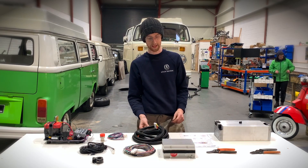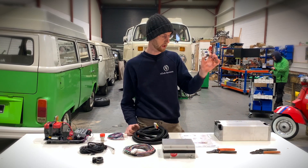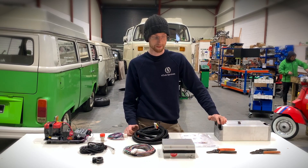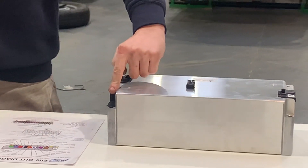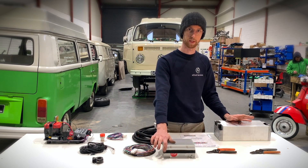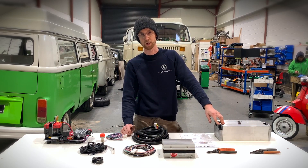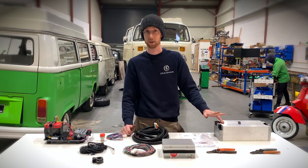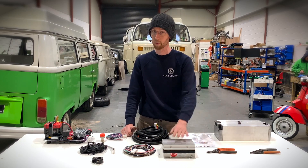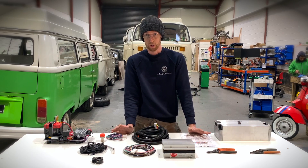In order to get these wires into your battery module you'll be using one of these connectors for an LG — others are available of course. What's really important, and I've learned this from my own mistakes, is to cover up this socket here. I've covered up these sockets and this socket because if any of those pins touch each other with metal or your finger, there's a good chance you will blow one of the fuses inside, and then it's off back to America to get repaired. So that's just best avoided.